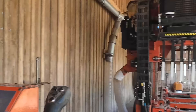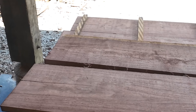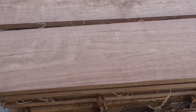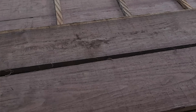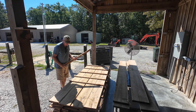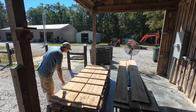Stickers are the little pieces of wood that go between lumber stacks right here. They provide airflow between the layers of lumber. Sticker placement should be right on top of the runners of the pallets that you built, hopefully watching my other video.